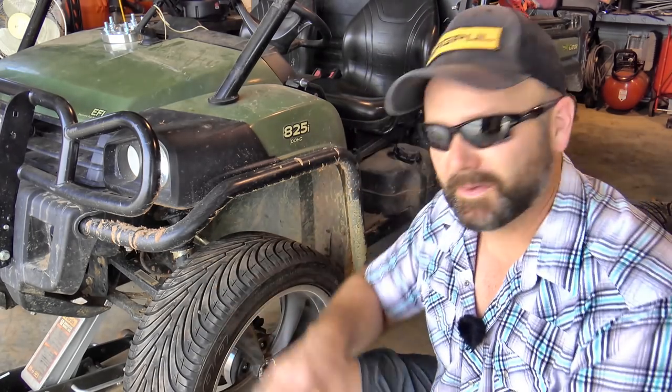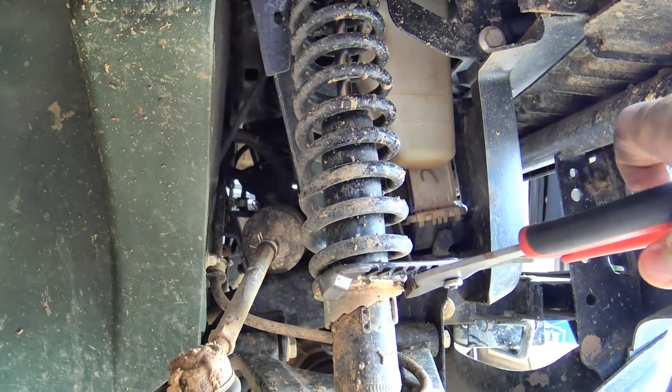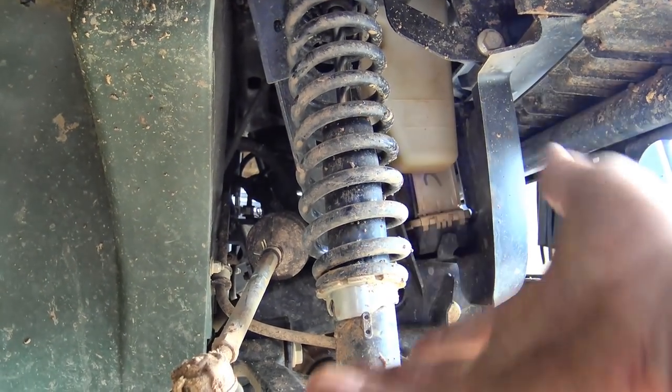It's a good looking set of wheels — these are the Boss Motorsports wheels. I just didn't feel like putting them on Craigslist to sell them, didn't want to fool with people. I think this is a much better fit. I'm going to go see if I can find the shock adjustment tool so I can raise the Gator up a little bit and give it more clearance. I couldn't find the exact tool, so basically all you have to do is take a pair of large channel locks and crank it up. You see these notches — that's the highest notch right there, and I'll just crank it all the way up. What this thing does is compress the spring and bring the Gator up just a little bit. I'd been thinking about lifting the Gator for a long time — if I'd known it was that simple I would have already done it. It's farm lost if you know what I mean — sometimes things get placed in different areas. That's why we've been cleaning the shop out, getting it organized. Got to be organized on the farm.